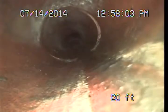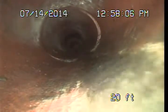So we've dropped down steeply, and then we're going to take another little bit steeper drop here in a second as we level off. Running out under the lower landing of the stairs, and then dropping again. And this is going to take us about to the depth of the public sewer. We're somewhere down near the curb face now, and we'll continue out, connect up to that public sewer. All of it looks pretty clean. I'm not seeing anything cracked or broken, significant damage to the clay. Basically a functional system.